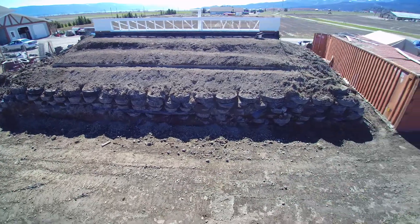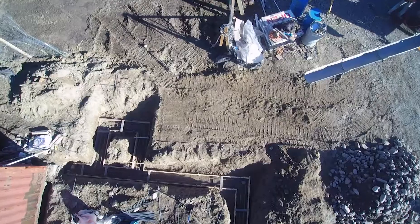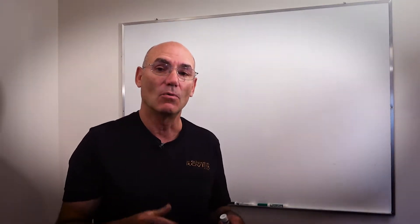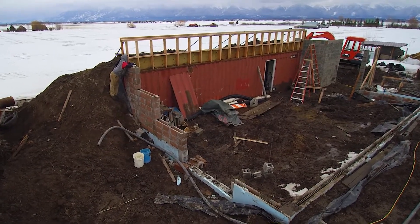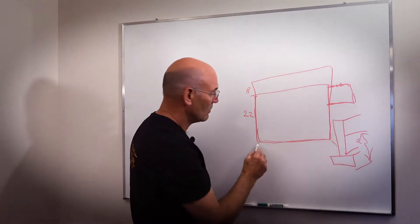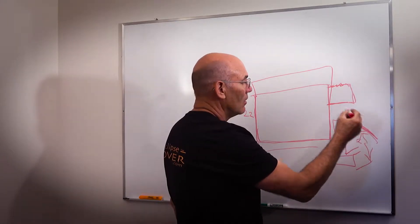After all that was done, the next step was to put in the footings and foundations — pretty standard construction. We put footings in the foundation around this for it to sit on, also below frost line, two feet below grade. The only two places where we'd have any weight on the footings was in the two corners of the greenhouse. On the west side, we staggered the cinder blocks and built up so we could put more dirt around the corner, then build dirt up around the edge so all four feet would be underground. After building the footings, we insulated all the way around.